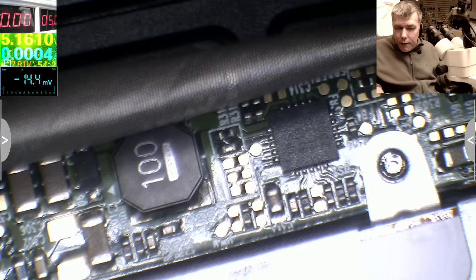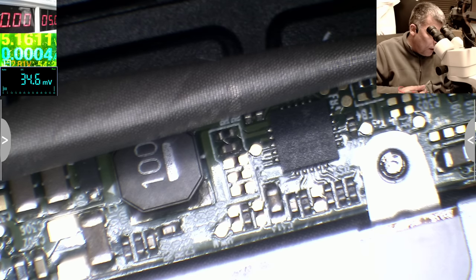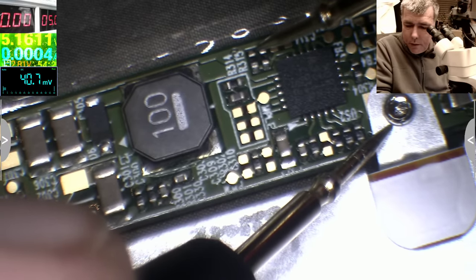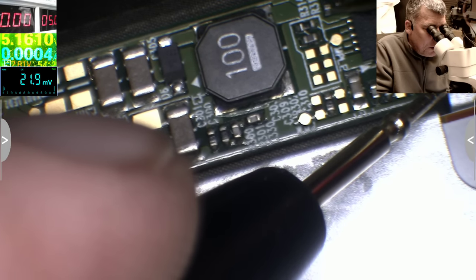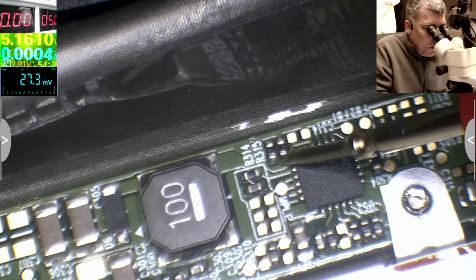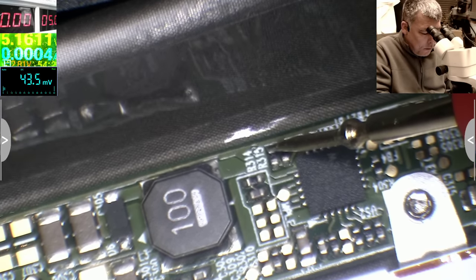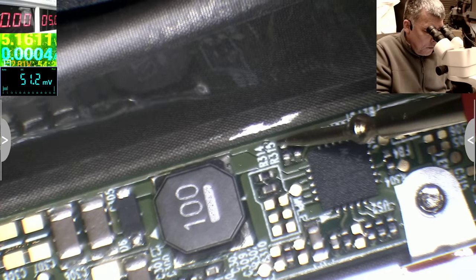You know how we can find it, we can put a multimeter. I'll take the beeping one. So I will check. Let's see this. This is going to ground. I'll check with my beeping one, yeah? So that's ground. This is not ground. So this resistor, if this resistor goes to my screen connector, sorry. So the pin from the chip is coming here. One resistor to the ground, one resistor is going somewhere. So if this is coming from my connector, that means that's my signal. And no, it's not coming from my screen connector. No, so it's not this one.